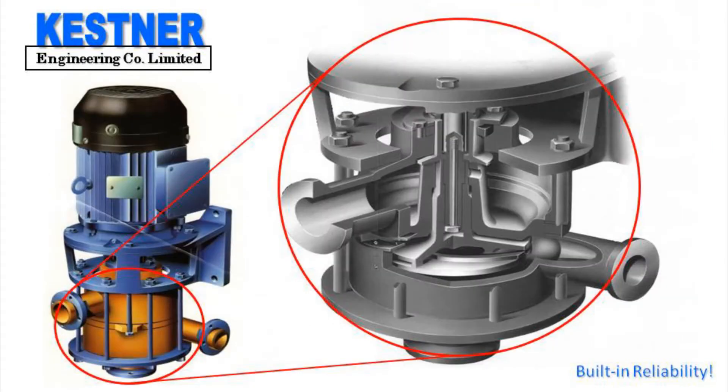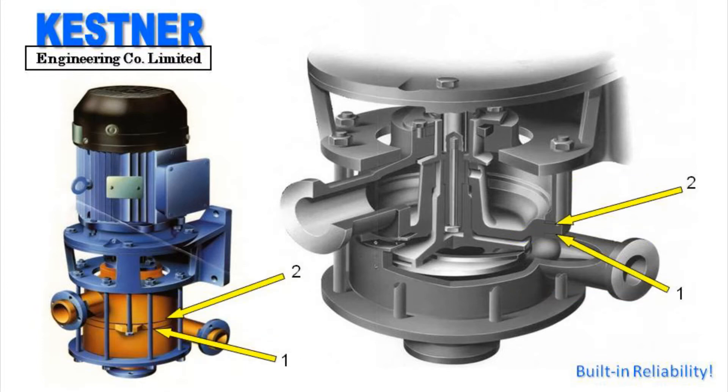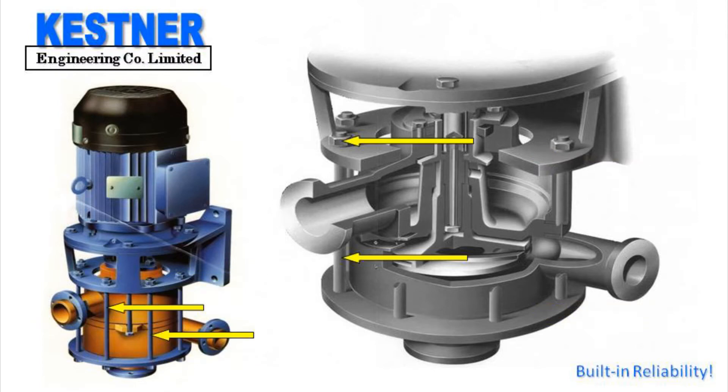And this is how it works. The pump consists of three casings which are separated by two gaskets and clamped together by two clamp rings and bolts.